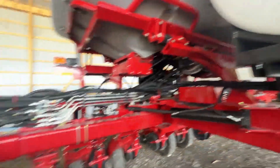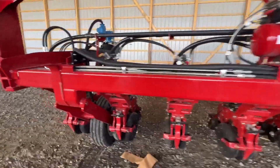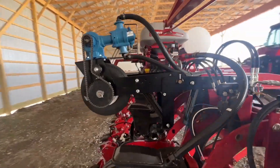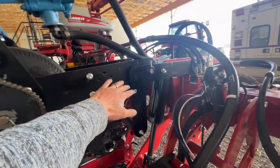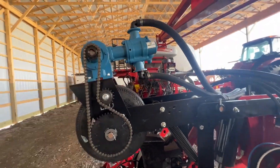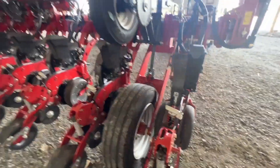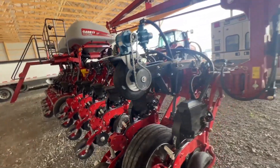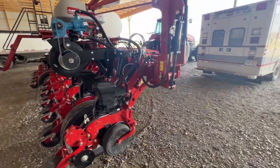We've got our fill port there, but I really like this planter and how we kept it simple. Just a simple ground drive — got a ground drive kit from L&D Ag, put a 40-55 John Blue on there, simple contact wheel. So when we let it down, we're putting fertilizer on. When we lift it up, we're not.